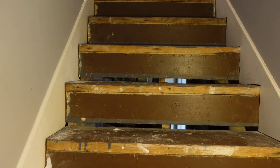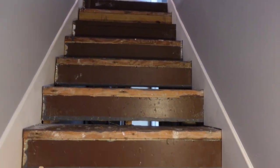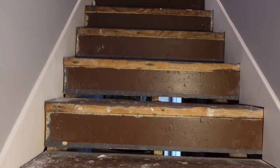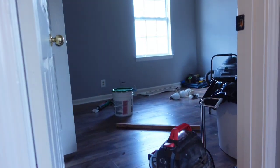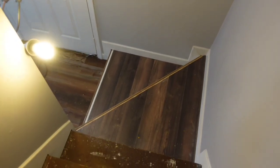What I'm going to do is go outside and cut some stair noses that are an inch and a half thick and about seven-eighths of an inch deep. I'm putting carpet on these going wall to wall, so I'll be putting tack strip on both sides and across the bottom. I still have a few things to fill in at the bottom, then we're going to bullnose-wrap these with carpet and pad. I also still need to do quarter round and I'll custom make stair noses for these stairs and landings. I bought a couple of 2x4s and a 2x8 - the 2x8 for stair noses and the 2x4s for custom laminate stair noses.